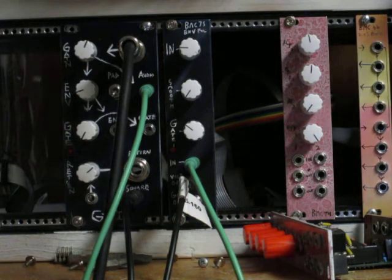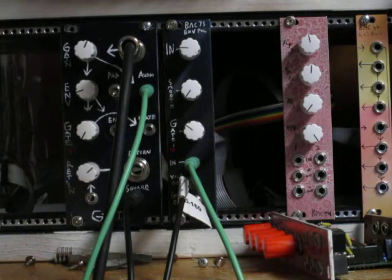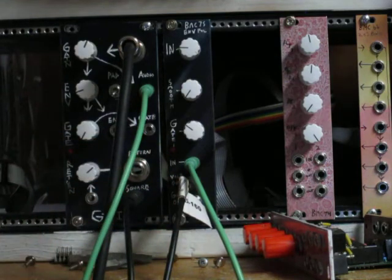Yeah, like I said, this is a more advanced version. The traditional circuit just takes the signal and rectifies it and then filters it a little bit. This takes the signal, rectifies it, and then samples it with a very high-speed, what's called a track-and-hold circuit, which is always sampling the highest voltage of each peak of the waveform. And it's always going to be 180 degrees out of phase with the waveform changes. Like, when it goes negative, that's when it's updating the voltage from the sampler to the output.